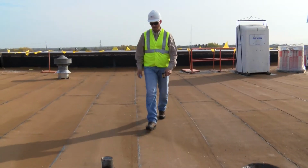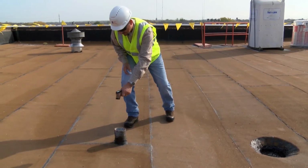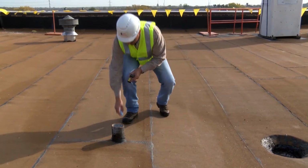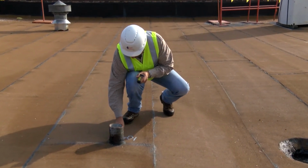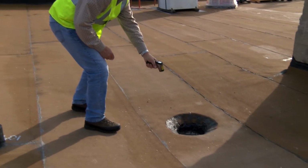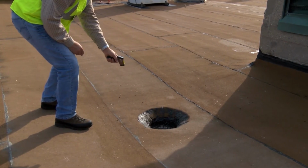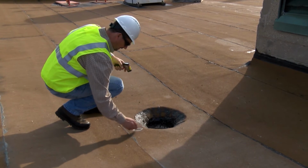A fire watch procedure is where a specially trained worker inspects recently installed torch-applied roofing materials to detect hot spots. In addition to keeping a watch throughout the day, he or she must continue monitoring the job for at least 2 hours after all torches have been turned off and all equipment and tools have been stored. Depending on building owner requirements, weather conditions, roof and building design, and adjoining materials, the fire watch could last longer.